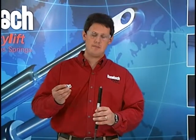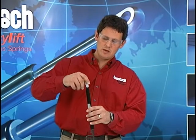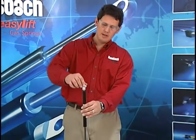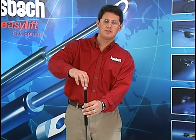You'll take your release screw and slowly screw it onto the threads. Make sure the gas spring is away from you and in a vertical position with the rod side down. Screw on the release tool just until you feel it bottom out onto the valve until it stops, right about there.